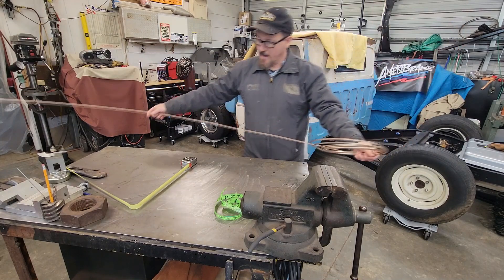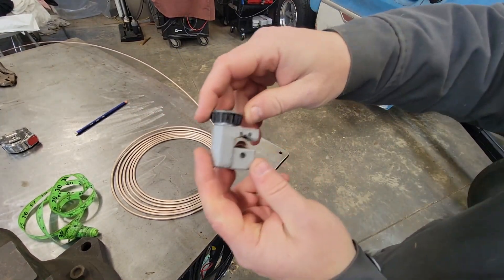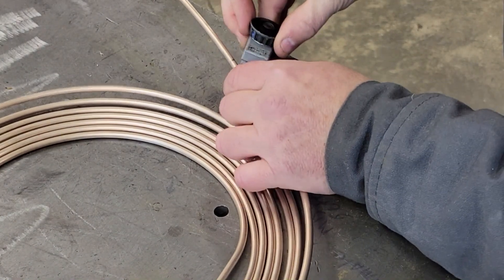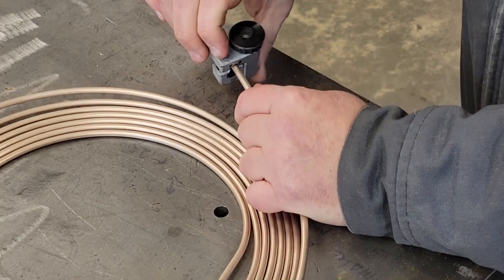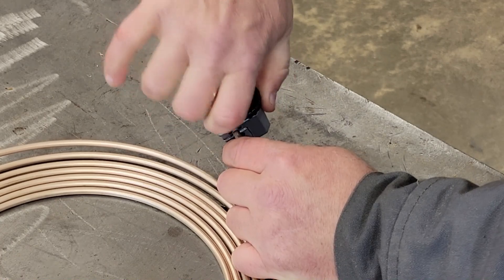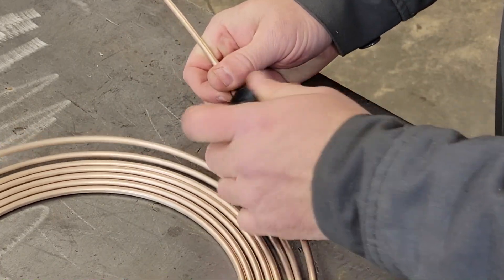That's not straight enough — and I'll tell you what guys, I really love to see good crisp tight lines. This is just a regular old tube cutter you can get. You just tighten it and go around, tighten it a little more, go around tighten it a little more and it'll cut. You don't want to crush it by any means. Just get to where it snugs a little, make it around until it loosens back up, tighten it — just keep going a little bit at a time, about every quarter turn. This gives you a good cut at the end.